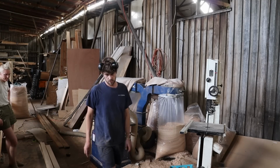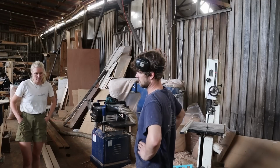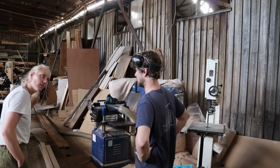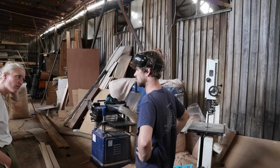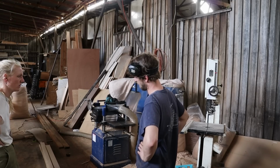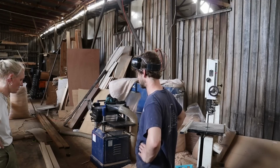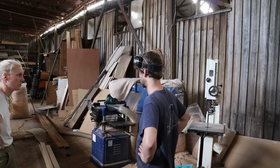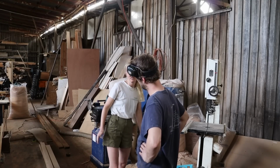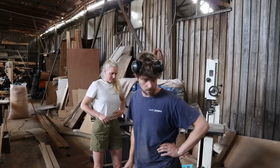It'll all get used. There's a small chance you might have to plastic nail them. Because I think it'll just be really easy then. Just in the groove. I'm totally happy to do it. Secret nail with plastic nails in the groove. And the theory is that the plastic melts the hole it makes anyway, so it fills it up. And then the thick set goes on top. No, I think that's a great idea. I thought we were always going to do that.